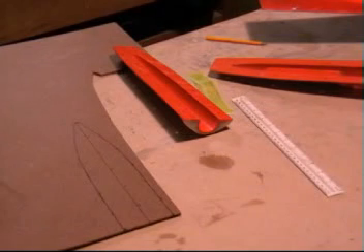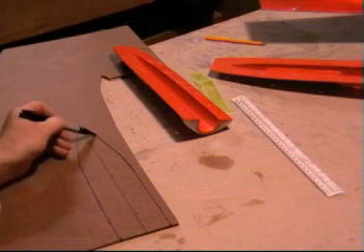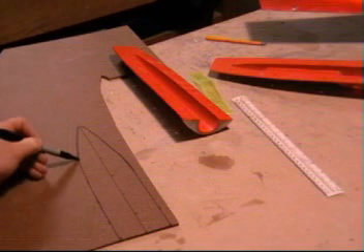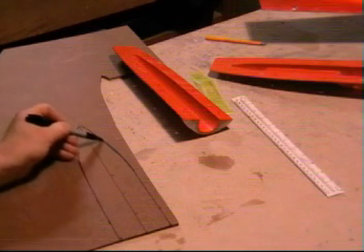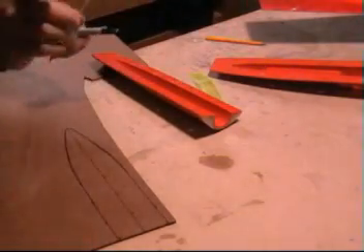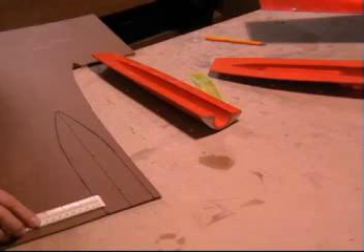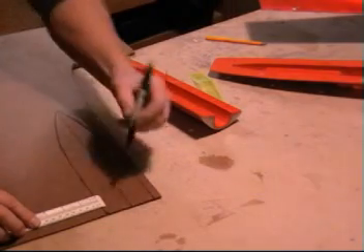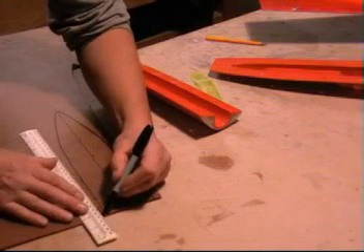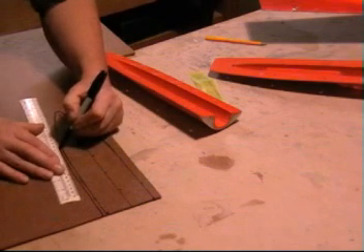There you go, that's the basic outline. Just need to flesh out the curves a little bit so they're not quite so straight. And there we have it — that should be pretty close to the projected surface of the mould. Now we also want an overlap, so for this I add on about another 10mm to one side. You could do this when you're marking out — just add on 10mm before you divide the overall measurement on the flexible ruler by two, but I like to do it this way. The fiberglass that you actually cut is so flexible that it works either way.